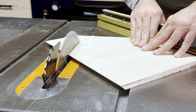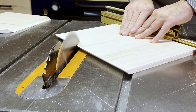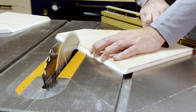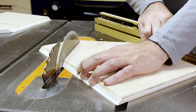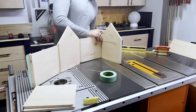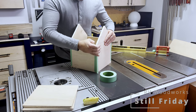This miter gauge was a lifesaver for this project. As I make this cut, you can clearly see that my angles were not correct when I drew the line, but thankfully the miter gauge cleaned it up for me. I need to call something out here — the height of the blade is way too high. Not only am I getting an immense amount of tear out, but this is not a safe practice. The closer the tip of the blade is to the workpiece, the lesser tear out you'll get. The happy medium is to have the gullet — which is the gap between the teeth — of the blade be just above the workpiece. We are back to the test fit with the roof-style box, and with the miters fitting good, we can move forward.